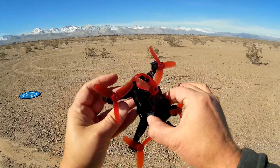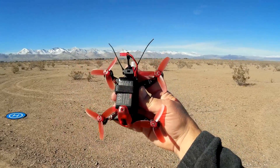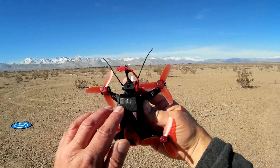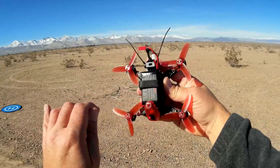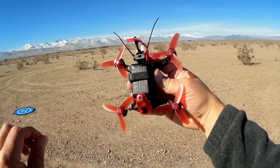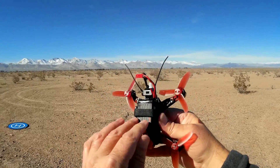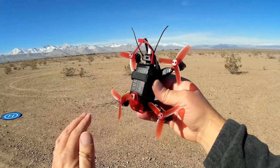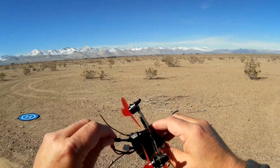Underneath the battery is access to the FPV transmitter. The FPV transmitter in this version I got is 200 milliwatt and 600 milliwatt selectable, with 40 channels. When it's set to 200 milliwatt low power, you only have band B — only 8 channels to select. But if you hold the little push button beside the channel switches, you can select 600 milliwatt. By doing so, you can select bands A, B, C, D, and E for the full 40 channels. And that's why I've got it set up to 600 milliwatt power.